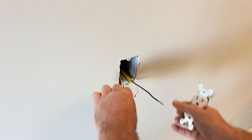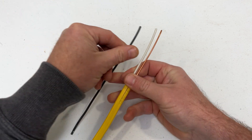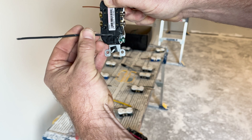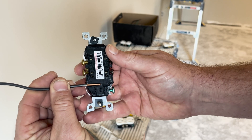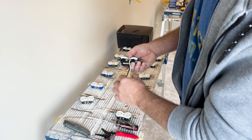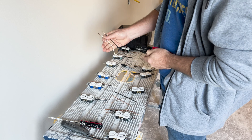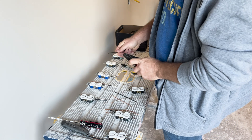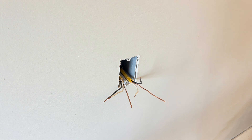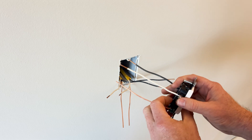Next, prep your outlet. Cut a six-inch piece of Romex and remove the black, white, and ground wires from the jacket. Your outlet will have a strip gauge on the back which you'll need to follow to make sure you strip the right amount of wire, then connect your black, white, and ground wires to the outlet as described earlier. Since the opposite side of those black and white wires will be connected with your wire nut or WAGO, follow the directions for whatever connective device you're using. You'll end up stripping the same amount of wire as you did for the black and white wires on the 12-2 Romex running into the electrical box. Now your receptacle is prepared and you tie it all together.